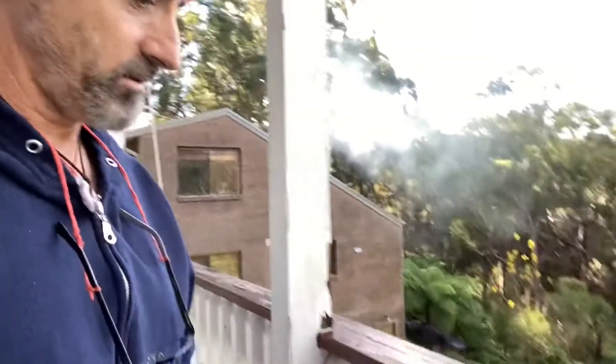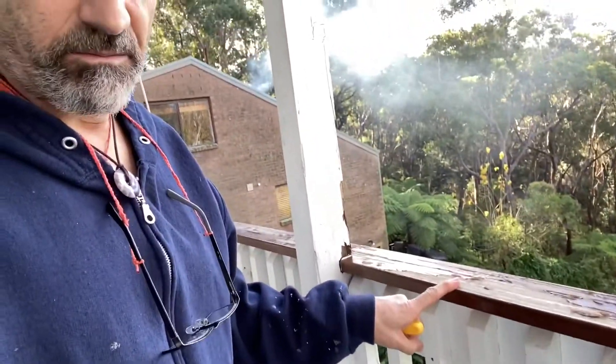That way this stays secure until the actual point where I just need to come up and put the rails on. I'll basically take the pickets off, take the bottom rails out, replace them, and then put pickets back and replace pickets as I need — because I'm sure I'll find out which ones are rotten as I'm taking them off. I'm also thinking these cap rails need to be refinished like I did downstairs, so I'll end up taking all those off and refinishing them all as part of the whole process.